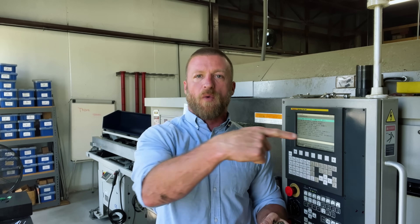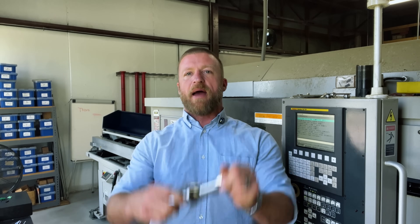And then your feed rate, of course, is whatever you would feed that drill at. I don't modify the feed rate higher or lower based on whether I'm using a standard G1 or a G83. G1 is your linear interpolation or feed move. My feed is my feed for my drill from my manufacturer. So the format is G83, Z, Q, F.